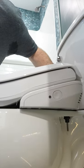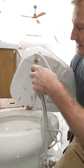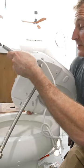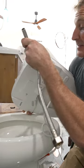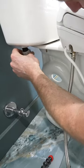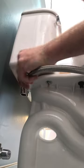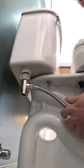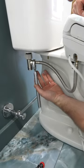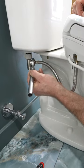You can even see how that button moved there. So when you slide it on, it clicks right into place. As long as this has this rubber grommet in there, you can just thread it directly onto here. It's important not to over-tighten this — just do basically hand tight and maybe a half turn past that. Thread this on like any regular valve. Go to hand tight and about a half turn or so past hand tight. You don't want to over-tighten these grommets.